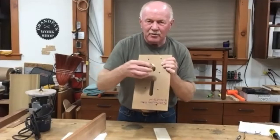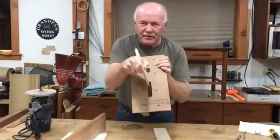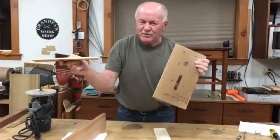You've made a wider mortise, but as long as you do the same thing with all of them, when you machine your tenon stock to fit in there, you make sure it's wide enough to fit what you did. Got it. Yeah. So it's doable. It's just something you need to be aware of. So you pay attention to the results you're having.